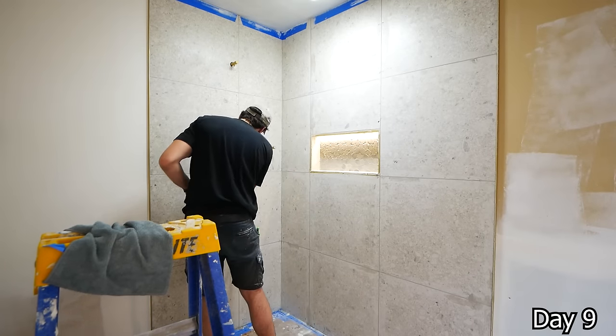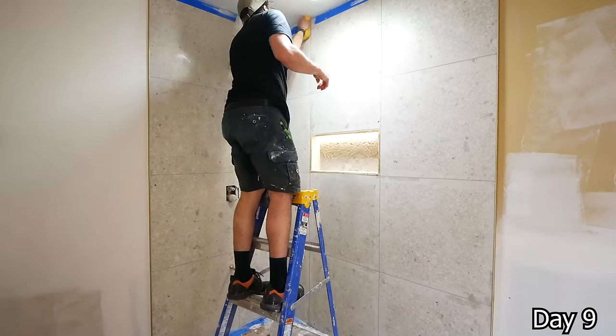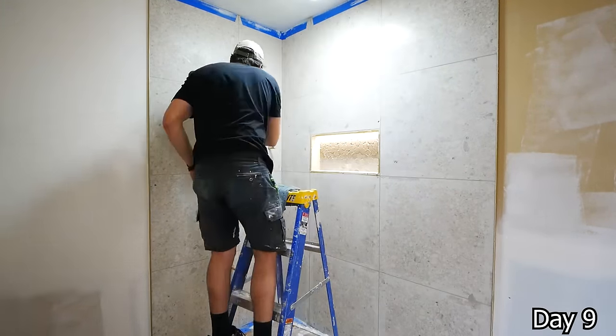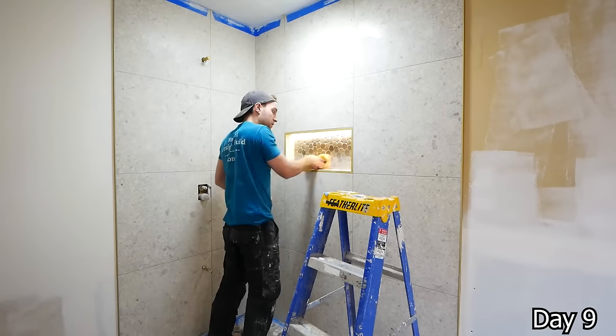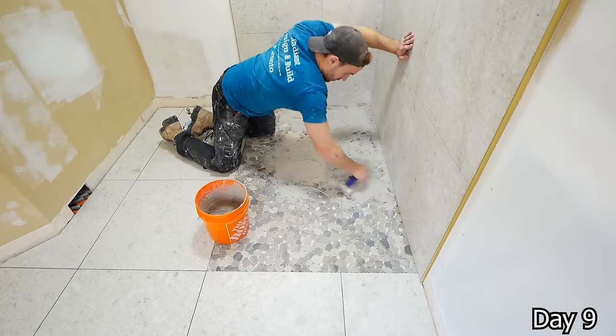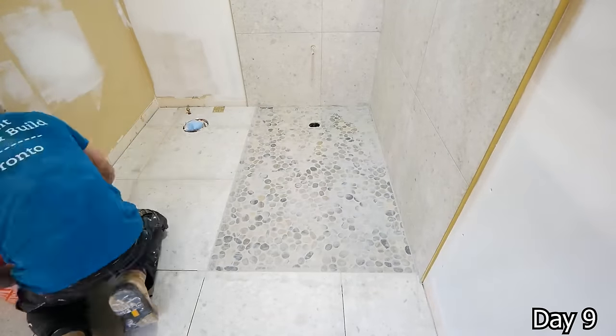general bathroom floor. Now, grouting can be one of those things where it's really easy to mess up. If you need to mix your grout like the one we're using here, you want to make sure not to make it too thick or too thin. You also want to be sure not to let it sit too long because the haze can be really difficult to get rid of. So what I would recommend if you haven't done this before is just do one wall